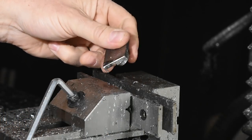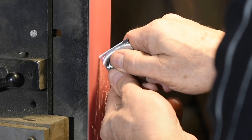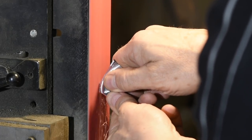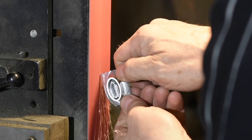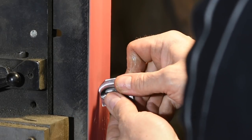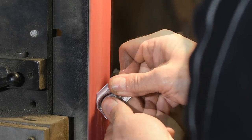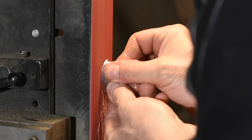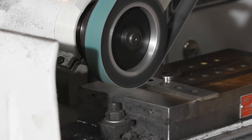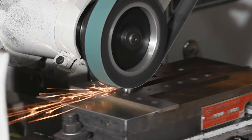Once the part was complete, you've got this big base that's left, so that has to be gotten rid of. I took the part out and ground off the excess on my grinder. Again, if this had been a production part, I'd have flipped the part and decked it, but that would have required some fairly specialized fixturing — much easier on a one-off to just grind it off. Once the excess was mostly cleaned away, it was back to the surface grinder to flatten the top face of the guard. Once you could see the slot for the tang peeping through there, you're done.